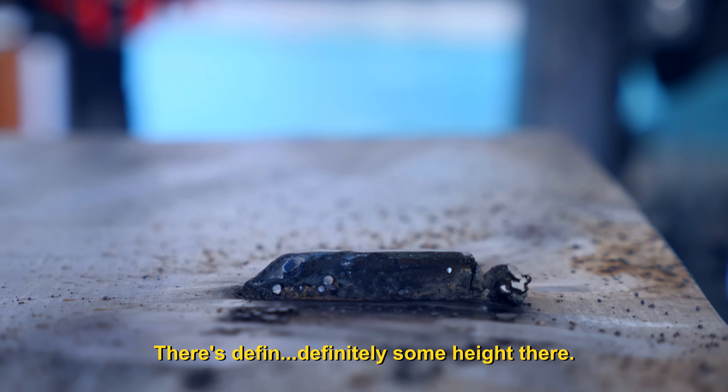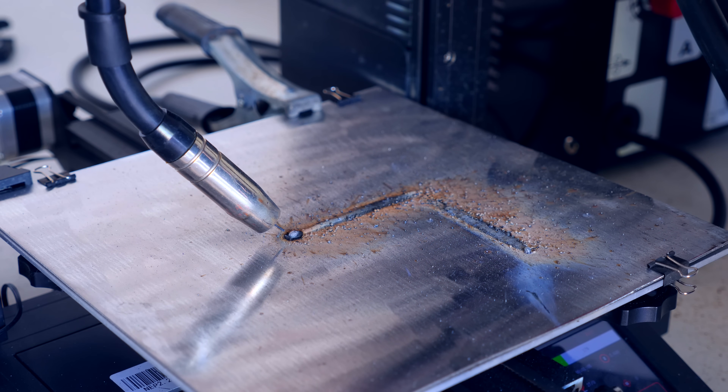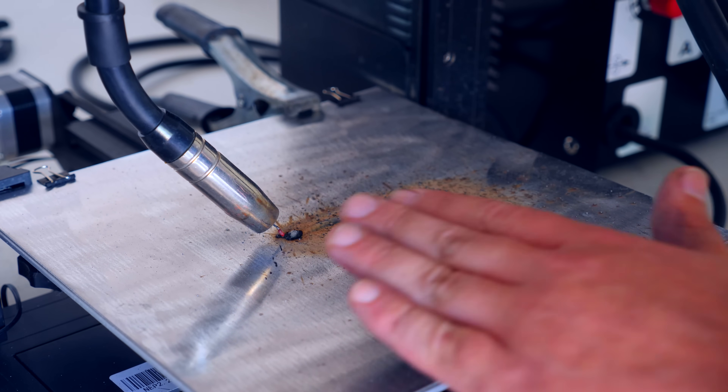I gave it a little grind so you can see — there's definitely some height there. We're getting somewhere, and that is what matters. The metal is not warping as much, but the printer stopped out of nowhere. It took me a while to figure out that the fault was on the printer's bed: I had set the bed temperature to 20 degrees Celsius, but the bed was getting really hot from the molten metal, so the printer would pause and wait for the temperature to drop back down. To solve this, I ripped off the temperature sensor on the bed so the printer had no idea what was going on.